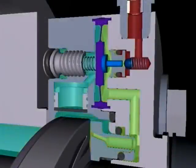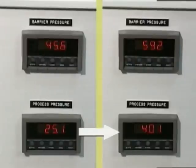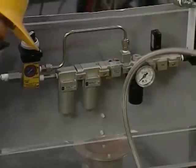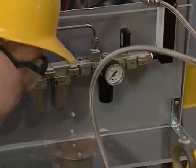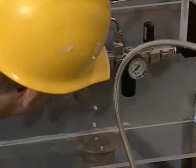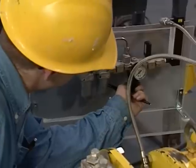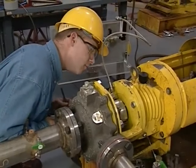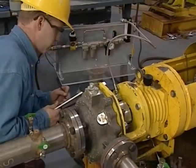The in-gland control system of the 4400 seal ensures that when the process pressure changes, the barrier gas pressure also changes to keep the correct pressure differential for optimum sealing. More reliable, less costly, and easier to maintain, the in-gland control system of the Chesterton 4400 twin hybrid gas seal is a significant improvement over the static pressure regulators used by other gas seal designs.